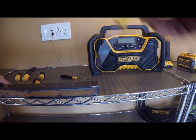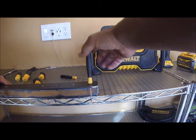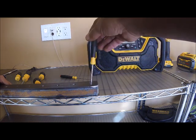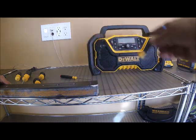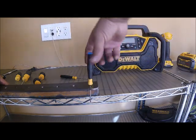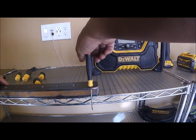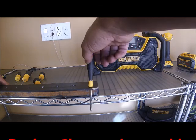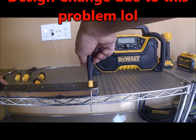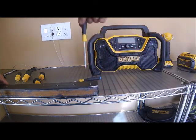Having a little problem with these little ones. They don't want to stay upright. They'll twist either forward or back or whatever. See that? So what I'm going to do is weld a little piece here and drill these holes. I'll drill those two holes, and I'm going to put a little piece here and continue the holes just so they can stay nice and straight.